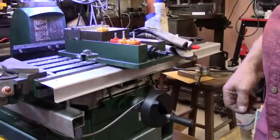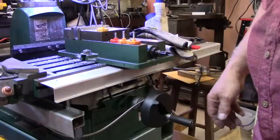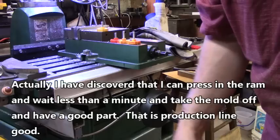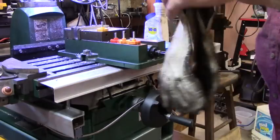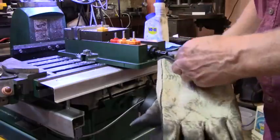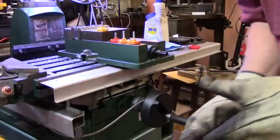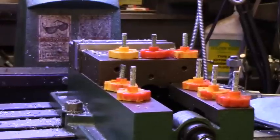That's more than double the speed, 20 minutes, and most of the time I spent goofing off with too many presses of the ram. I've learned now that when I screw the little top piece of the mold on, I'll wipe his chin to get the plastic off that's dripping down, the little drool, and then clamp the thing together and it'll all warm up and work out just fine. And of course the drool I wipe off, I can stick right back in the hopper. I couldn't help playing with the machine, so now the price per knob is down, who knows, maybe to the $15 or $20 range. I'm getting close to the hardware store price. A couple dozen more and I'll be down there.